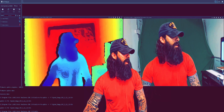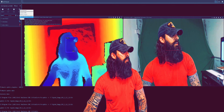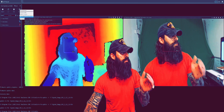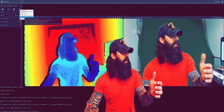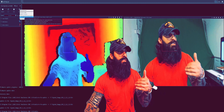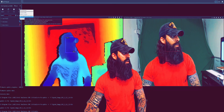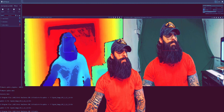Let's start with the on-chip calibration first. When you come down to the pull-down menu you'll see the on-chip calibration option — this wasn't here two SDK upgrades ago. What this allows you to do is point it at the scene and it'll reflect all the depth pixels up to 50 percent, perform a health check, and return a calibration value. As long as the result is within plus or minus 0.25 and comes back as good, you can apply those new calibration constants — both intrinsic and extrinsic.